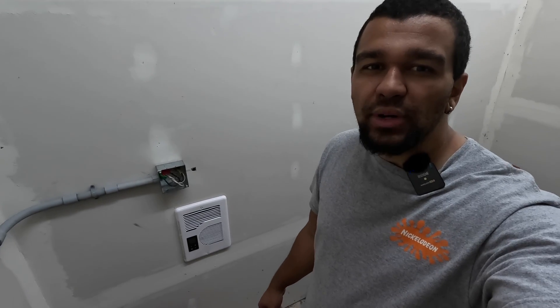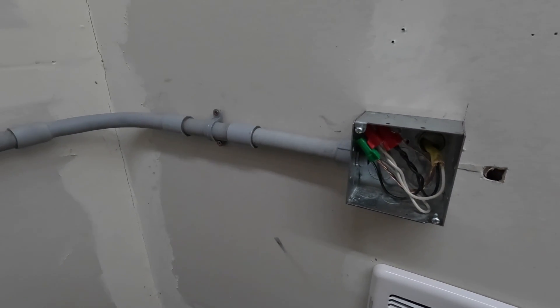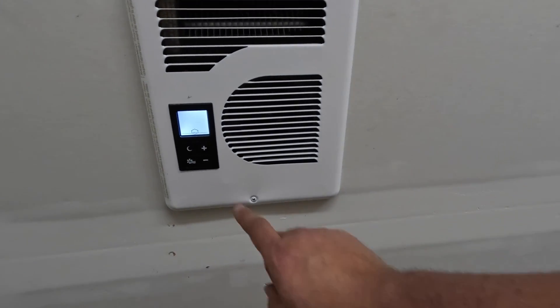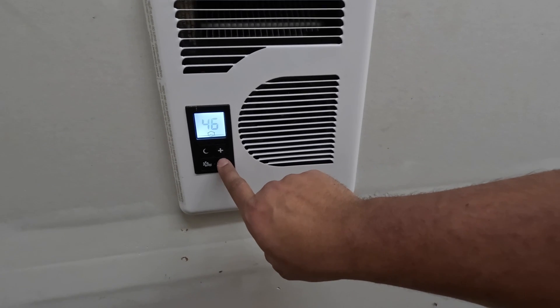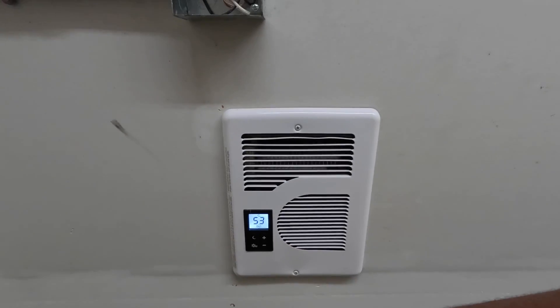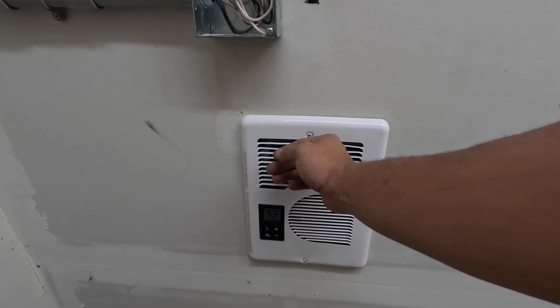All right y'all, let's show you the install. We got the heater down here, j-box cut, all our wires wire-nutted into conduit into the panel. And now let's flip the breaker. Right now it is set to 45 degrees — for freeze protection you want it between 45 and 50 degrees — but we're going to turn it up to 70 just to test it. And there we go, nice, coming out warm. Here's the inlet, here's the outlet. Perfect. That's going to wrap up this video on installing freeze protection in the well house — like, comment, subscribe, and we'll see you in the next one.